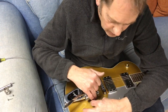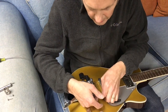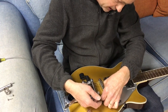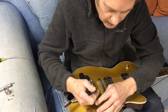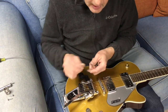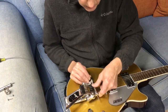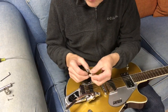From the top it's going to look like you're turning it clockwise, but you're really turning it counterclockwise, which is going to loosen it. Get up in there and rotate that around until the screw has released tension. You can then take the end of the Allen wrench and push the axle right out, which is going to release the roller.